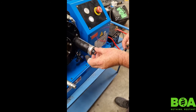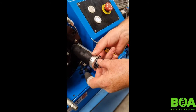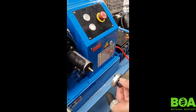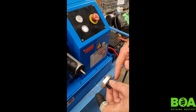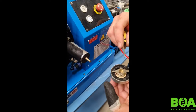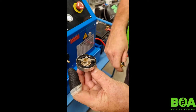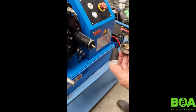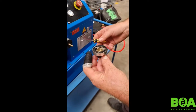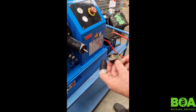Don't screw it right out because they're easy to lose. Then you slide this whole piece off the shaft. You haven't moved anything on the dial or the shaft. This keeper on the back is very, very important — it stays in the same position. Don't lose it; they're pretty hard to get hold of. It's designed to locate in the little pins around here and it locates the dial where it should be.